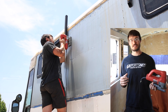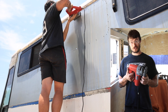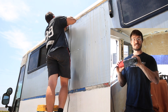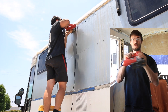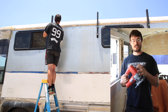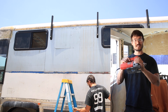A couple of tips. When I was operating the jigsaw, I always had two hands on it. The hand on the handle was obviously pulling the trigger, but it was also pushing the jigsaw into the surface so that it doesn't buck out. The other hand was slowly guiding it along — either pushing from behind or pulling from the front — and that gave me a nice, steady, slow progression across the metal. You want to let the tool do the work and not go too fast. That's something I learned the hard way. It's nice to just go steady and slow.